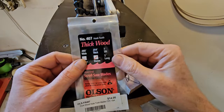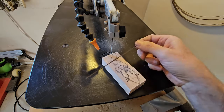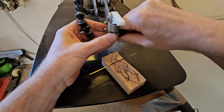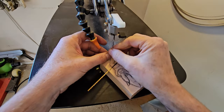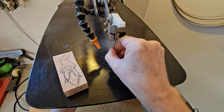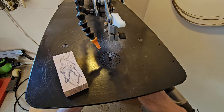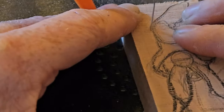You can carve all of it out, but I have a scroll saw - this is a pinless scroll saw, which means it doesn't have pins at either end of the blades; it's held in by a clamp system. I'll do some of it on the scroll saw and some on the band saw. My favorite power carving tool is probably the band saw because you can do much more on it, but for really small carvings you'd probably use the scroll saw.